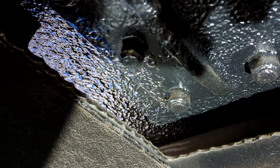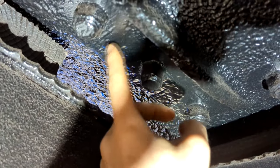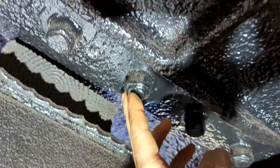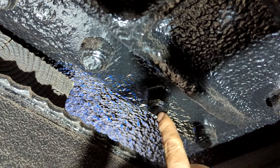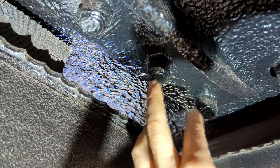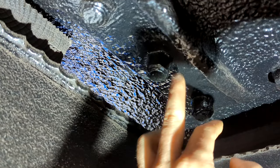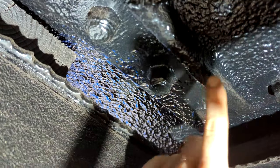I took a good look at these before I grabbed the torch. Some of them look rounded — they're so rusted they've lost the hex of the nut. My plan is to try a pipe wrench on those. The plan is to heat the nut red hot. When you heat the nuts you're trying not to heat the bolts — two reasons: you're expanding the nut and you're getting the dirt out. I like to stay away from the stud because if I heat the stud and the nut together, they just expand together and it's more difficult. I'll heat just the nut, get it cherry red, use a rosebud, and try to back these off.